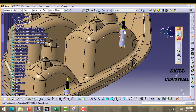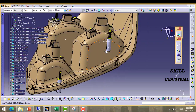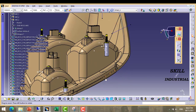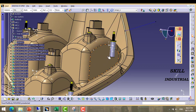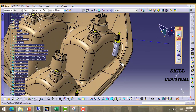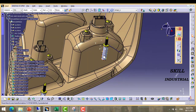It is not possible to extend this feature up to that surface and mold this part perfectly. We will face some issues: first issue is sink mark issue — at the opposite side of this part, a sink mark will develop. Second issue is from a strength point of view — this feature will extend to too much height. To maintain this height we need some strengthening ribs, but there is a space constraint, so we cannot provide all-around strengthening rib to this round feature.